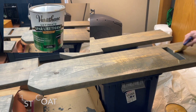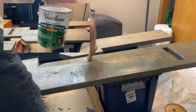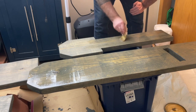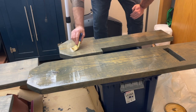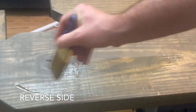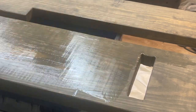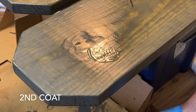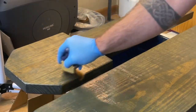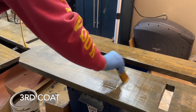We're going to be using a polyurethane — it's an extra oil-based polyurethane by Varathane. If you're using this product it's pretty simple. You're going to be applying it using a brush, and we're going to be waiting approximately four hours between each coating session. We're going to be covering the front and the back, making sure we allow for enough dry time. It is going to get a little tacky — we want to keep applying it. If you go over the 12-hour marker you're going to have to sand it prior to re-coating. They have a minimum recommendation of three coats, a 12-hour dry period before light use, and three days until you can use it like normal.